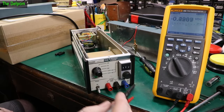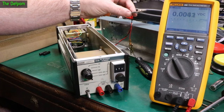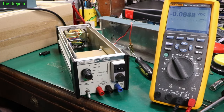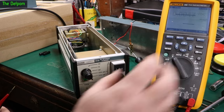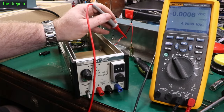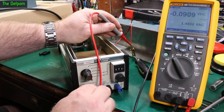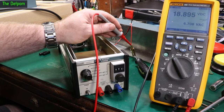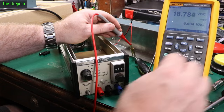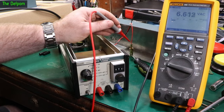I've just got the Fluke here. I'm going to check the battery connection, see what voltage it's supposed to be, then see what the outputs are when I turn the thing on. I'm thinking this may actually be required to load down the power supply circuit and add smoothing — but I don't know. There's that capacitor, it might be fine without it. Let's do a DC and AC measurement to start — measure both and check the ripple. We've got some AC noise here, that's probably just floating ambient readings. So let's turn it on. 18.8 volts there, 6.7 volts AC ripple — it's probably relying on the battery to do smoothing, so I have to watch out for that.